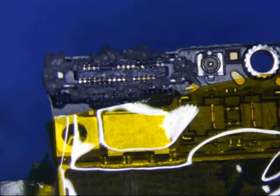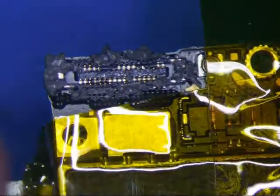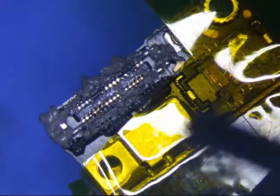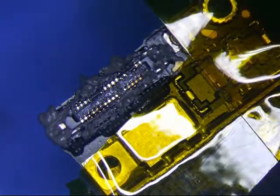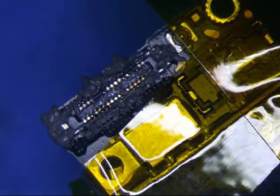Put the cap down on it — I don't want to melt this little connector right here, it's got a little plastic on it. So direct the heat away from the battery connector. I think I'm at 315 degrees, but you can probably go a little lower.